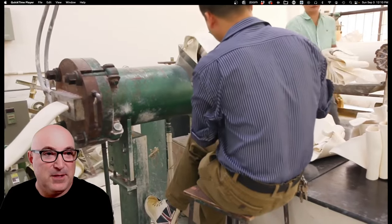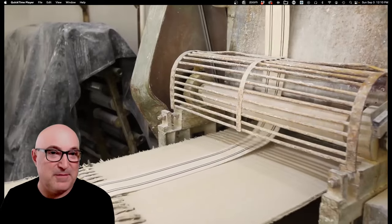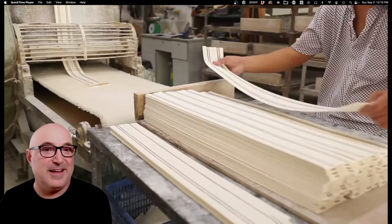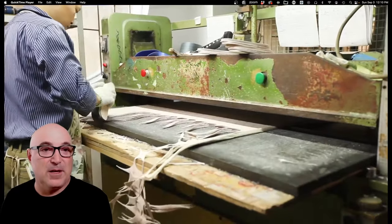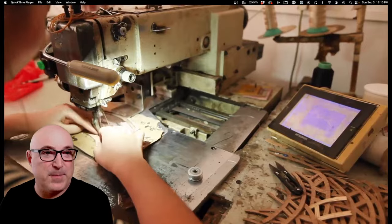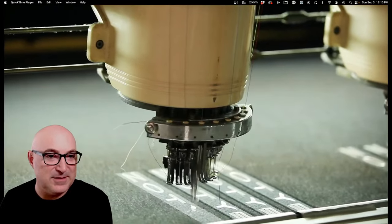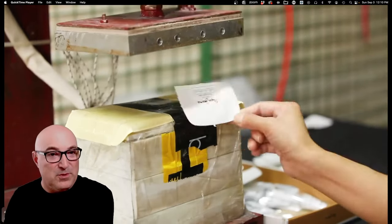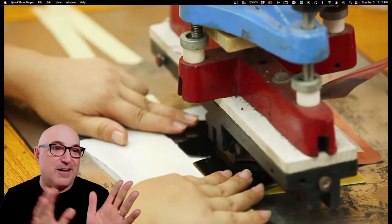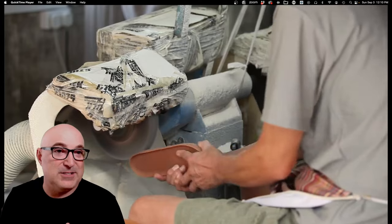Here's the worker using the mixing mill, feeding rubber into the extruder, and here's the tape coming off with an automatic cutter to cut it to length. Now we're preparing the upper on the other side of the factory — using a cutting press, doing some computer embroidery for logos, and a screen printing process. The rubber room is kept separate because it's really dirty.